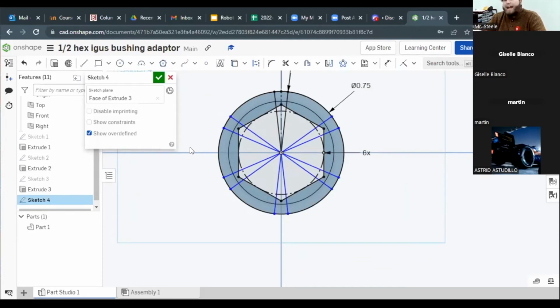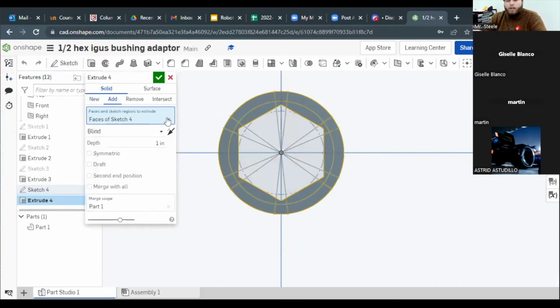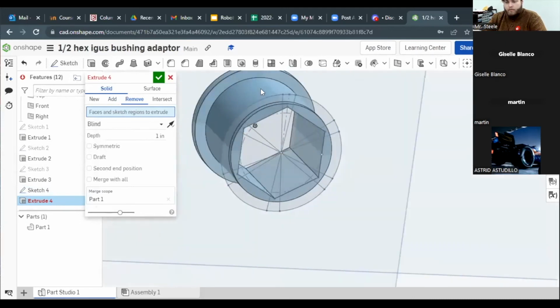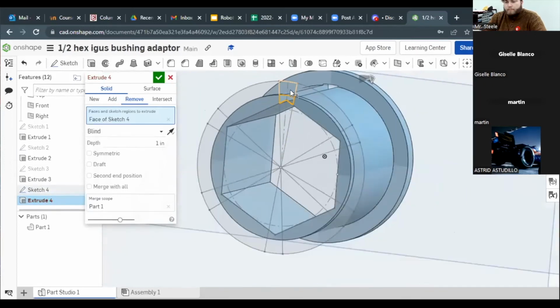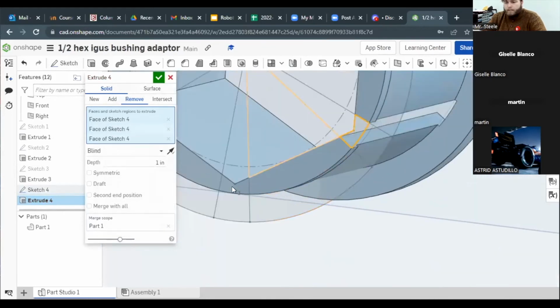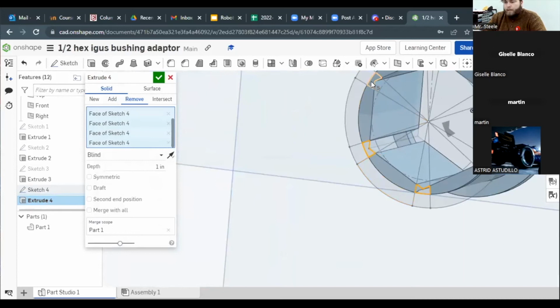So to reverse extrude, we act like we're going to create a new part by doing the box on top of a box extrude tool. But now we want to delete the faces that we've selected and switch tabs from adding a solid to removing a solid. Now we can scroll in 3 dimensions to view what we actually want to select as removable. And I'm going to select this piece here, this piece here, this piece here, this piece here, that region there, and that region there.